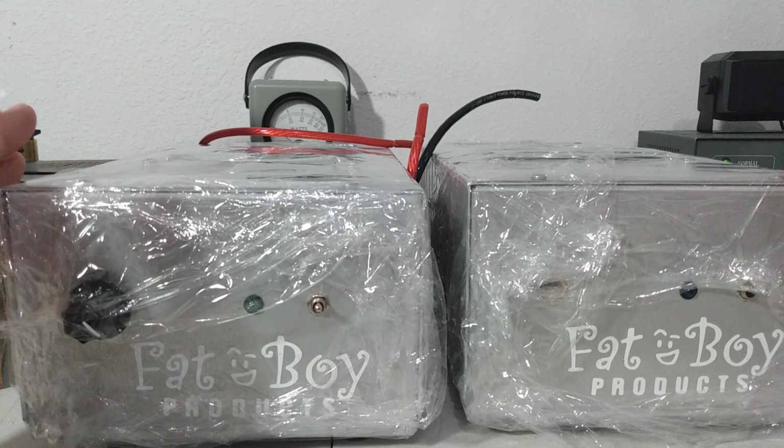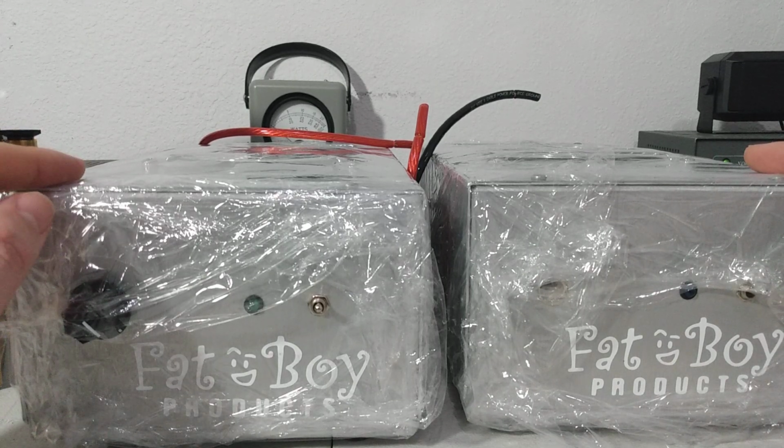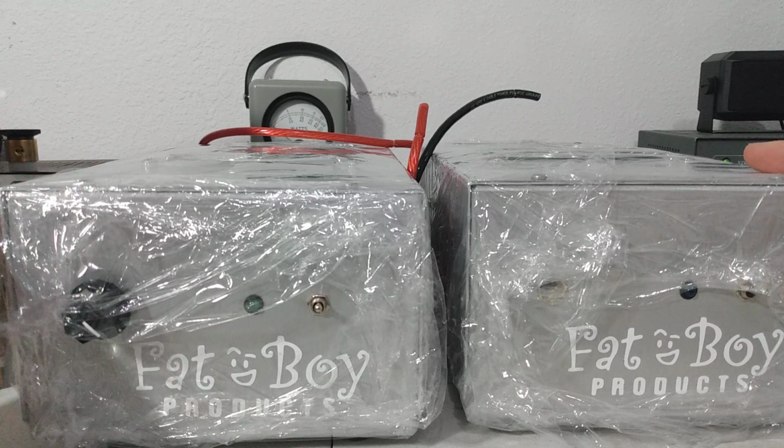Now this is more along the lines of what I think about when I think about high drive and low drive amps. This amp over here to the left: 35 to 40 watts PEP, 2 watts dead key going in. Now that sounds awful familiar. That sounds like I'm describing the 503 high drive RM Italy. Well, that's exactly right, and that's getting back to what I told you guys about different types of amps having different parameters of what they consider high drive and low drive.